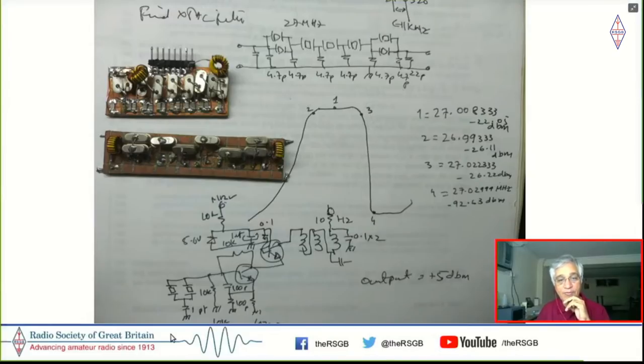And for the BFO, I had to pull the crystal off by 25 kilohertz with just a 1 pF capacitor. And this was proving to be unreliable, because at times the 1 pF was, with some crystals, not enough to make it oscillate at all. And later on, I switched from a crystal oscillator to using the SI5351's output itself as one of the oscillators.